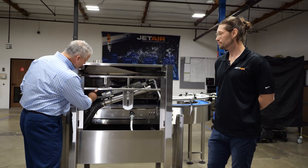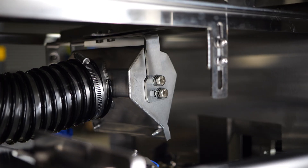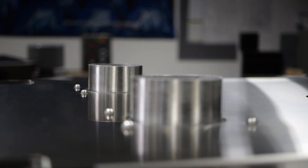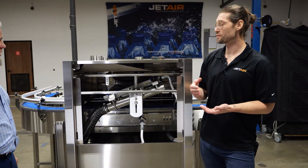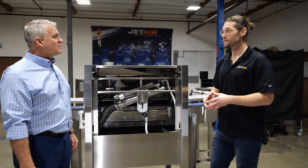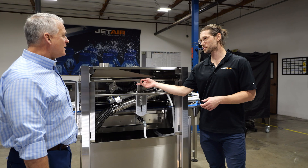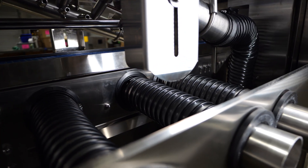Two more things a little bit closer to the top: I see another air knife that looks different — it's a traditional air knife. And then I see these two hoods. We use the traditional air knife for any surface that is flat, just like the blade — it does a really good job. The hoods are there because we don't want that powder to accumulate; we talked about that — it's going to cause combustion. So we pull it out through the hoods and these inlets, and we actually have another one at the bottom too. All vacuumed away.